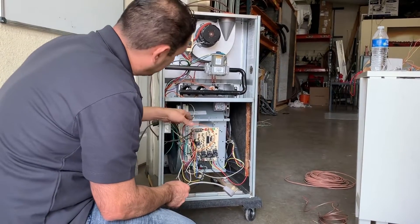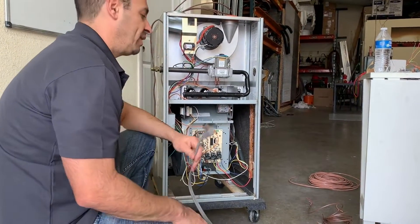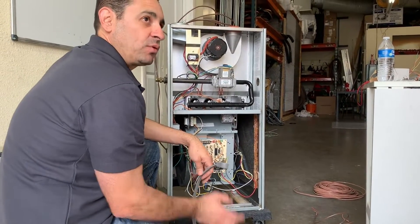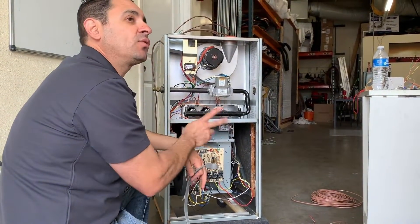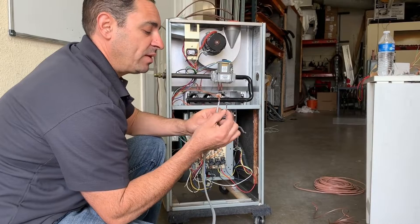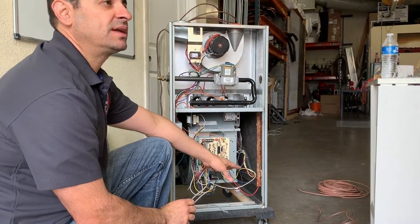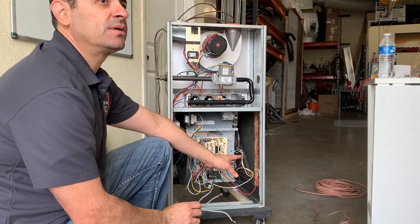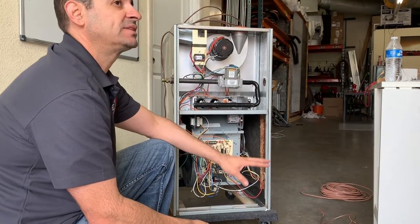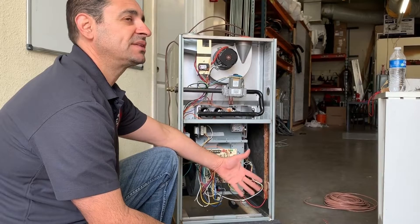The question is how do you connect it to this unit. On the transformer you had a common and then the black one. There is a right and a wrong way — if you connect the pigtail with the white one and the black one reversed, you might reverse the polarities and it won't work. It'll give you an error code saying bad polarity — fix the polarity, otherwise it can't operate.